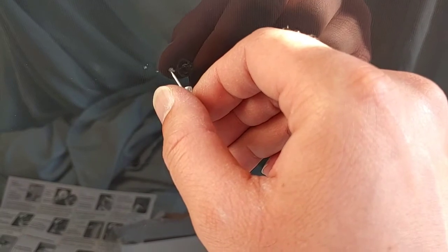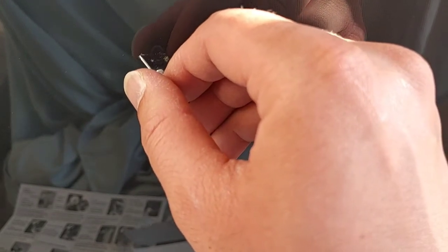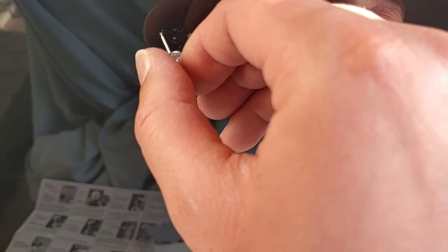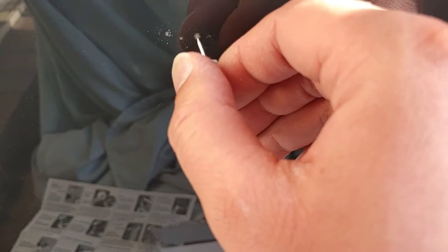Alright, that's pretty good. Now I'm going to take out this little push pin. I really don't think there's anything in there, but it says to try to clean out any loose glass or whatever might be in the crack. Actually, it looks like there is some stuff in there — there is some stuff coming out. I'm just going to clean it out a little bit. Obviously you don't want to do it too much because you don't want to make the cracks worse, just get the loose stuff out. You can see all those flakes of glass I got out with the push pin. Now I'm going to take my cloth and wipe that away.